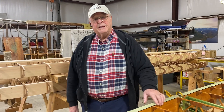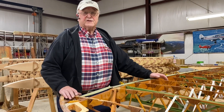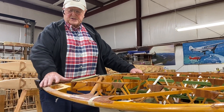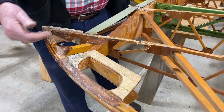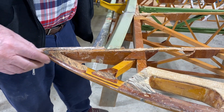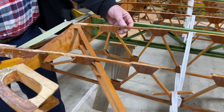Other typical damage to the Stearman wing in a ground loop is the wing strikes the ground as it's spinning around uncontrollably and it'll scrape the tip bow back aft. In this instance it actually just scraped the plywood right off the wing tip and it also produced some other damage.